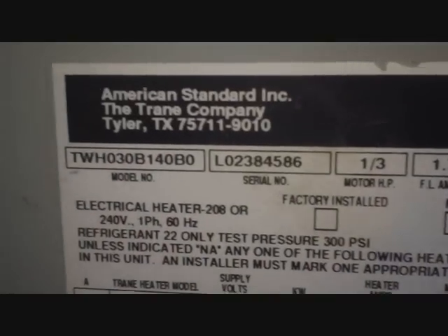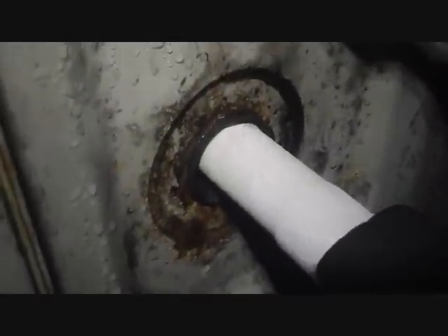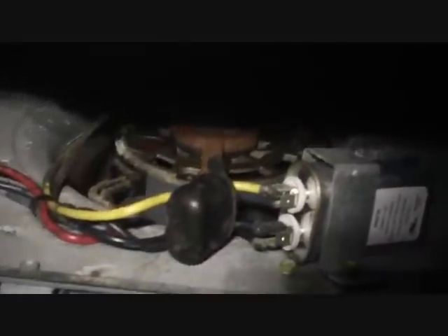This is the air handler we're changing out, and I'm at the air handler door to check the indoor coil to see if it's frozen over — because we've been freezing all day and it's been getting worse. I'm going to see if the coil is totally blocked with ice and we'll need to let it thaw out. It's a good time to change the unit so I'm glad we're doing that, but I want it to last another few days so we can finish the whole install. After we gave the blower wheel a spin it took off, indicating the capacitor was bad. This blower is old enough that it might have destroyed the capacitor — it looks like a Trane replacement blower because of the terminal strip where the tabs plug into the motor, but it'll take off for now and give us some cooling. I might just leave the fan on or replace that capacitor since they're so inexpensive.